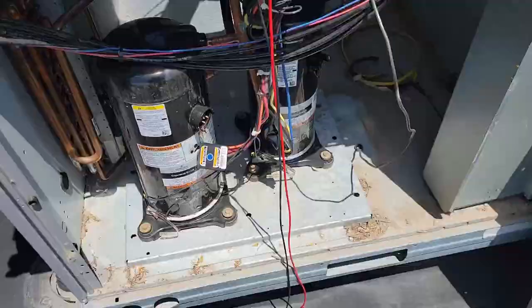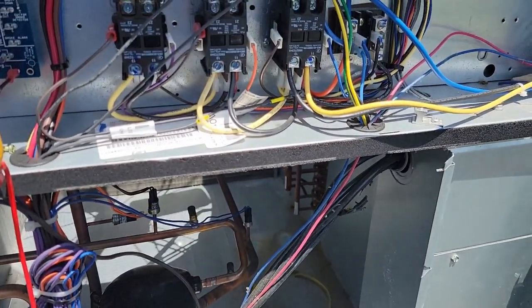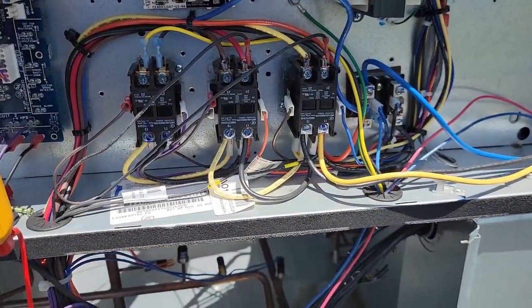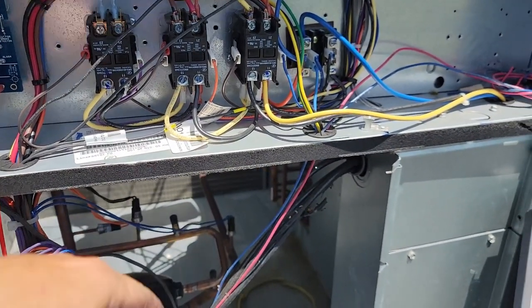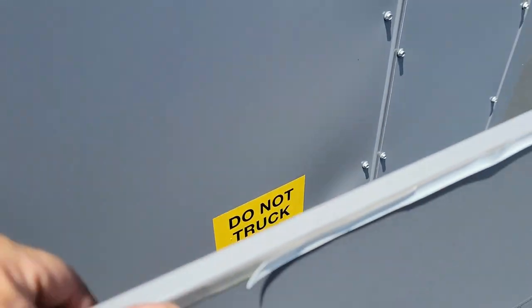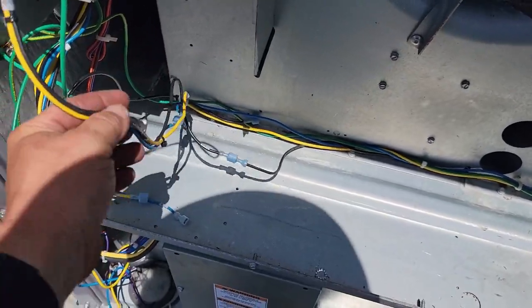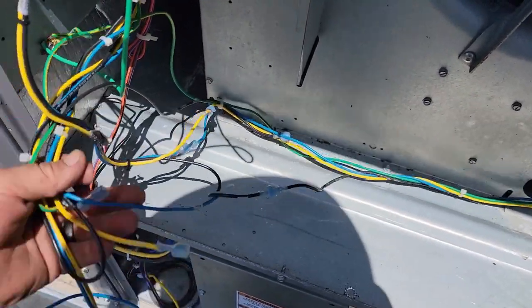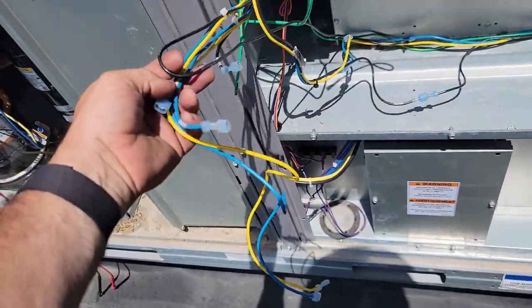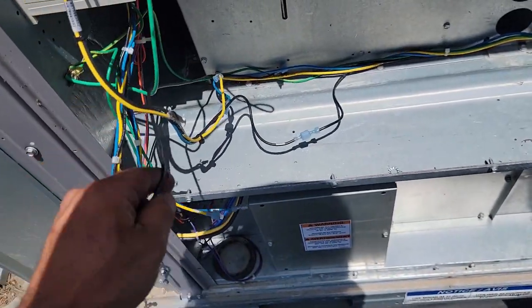Might be shorted winding to winding — it's always something. It's a 2020, two years old and already something shorted out. All right, so we checked the resistance on each individual compressor — half an ohm, nothing to ground — so now we're up to the motors. Everything here, nothing shorts to ground. So I'm thinking about maybe isolating this and the VFD, because the VFD definitely has a tendency to go bad.